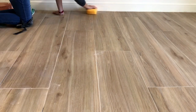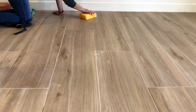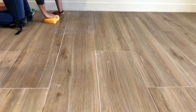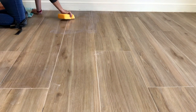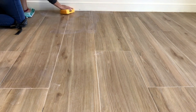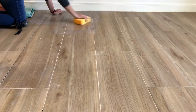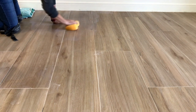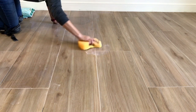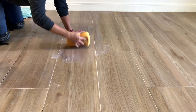Once you've completed that whole section, get your clean wet sponge, squeeze it out — you don't want dripping water, just damp enough to wipe away residue and smooth along the grout. I slowed the video down so you can see that I'm scrubbing hard on the tile but not on the grout line, so I don't accidentally scrub away any grout. You want the grout line to be level with the tile, or just a hair beneath it. Be gentle near the grout line and scrub away residue only on the tile surface, then lightly wipe across the grout line to smooth it.